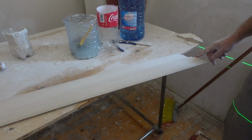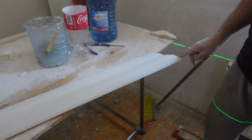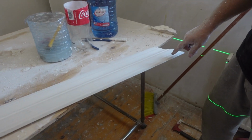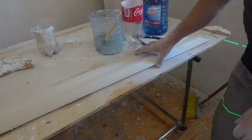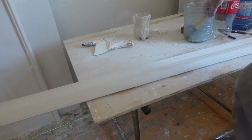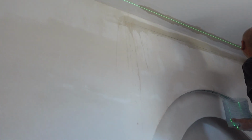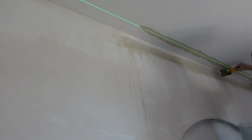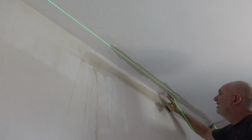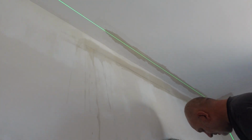And we cut the same way the 45 degrees from this side. Don't forget the heavy side will be the bottom side of the Gypsum Cornice, and we need to not allow the gypsum powder to dry so fast, and we saw the wall and ceiling, and you see I scratched off the whole painting here.